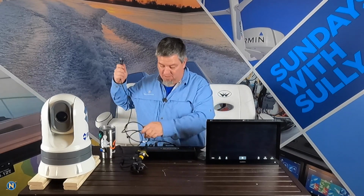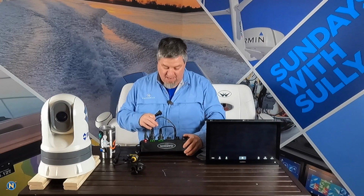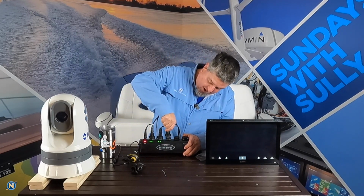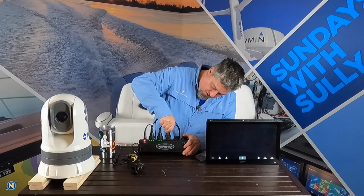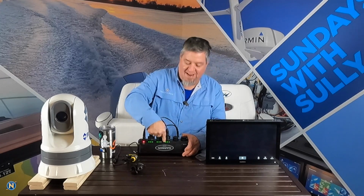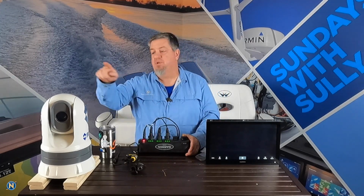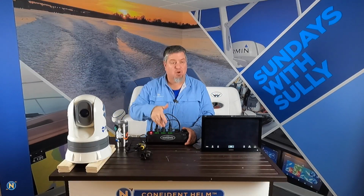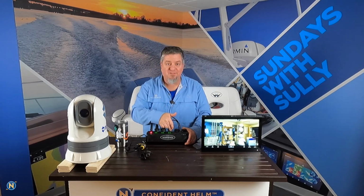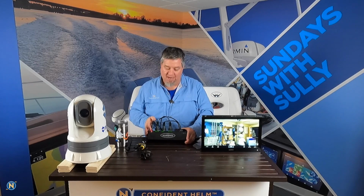And then the next thing I do, very simple, and this is the nice part about the marine network, I'm going to take this cable right here, same thing, I'm going to drop it in. And once I get that dropped in there, you're going to see this guy starts lighting up green. So now we know this is communicating back to this. As a troubleshooting method when we're talking about the marine network, one of the first things I always talk about is go to the hub, see if it's actually talking, see if we've got a green light going on there, see if it's communicating.